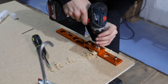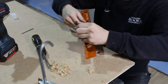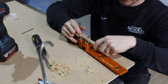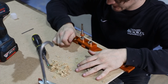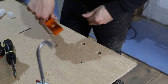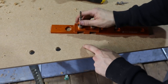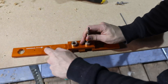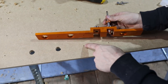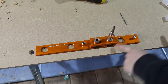Number one done. Taking this out, the drill bit won't fall through onto the concrete floor - a handy feature. Now we've got to flip the jig around so it's above the next hole. I can get a guide pin here, and I can still use the corner pin which will be sufficient. Be wary - this is MDF, you can get a vacuum attachment for this, which I don't have but is definitely worth getting. At this point, we want to drill this next hole out, but there is nowhere for this jig to locate on this opposite edge - these pins are already drilled out, and the other holes have nothing lined up with them yet. So we need to skip that hole, use that one for pin alignment, pop that in, get another guide pin in this side, and drill another two, skip the next, then another two.